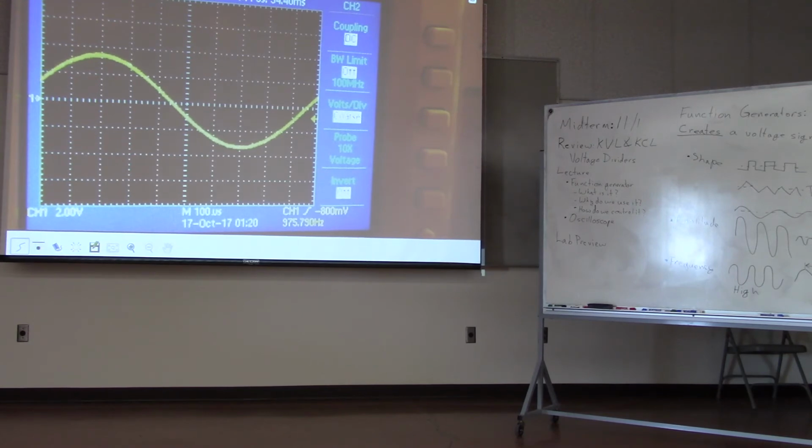If it had a period of 1 millisecond, what would the frequency be? Remember, frequency is 1 over the period, right? Well, 1 millisecond is 0.001 seconds, right? So the frequency would come out to be 1,000 hertz. Okay? 1 over 0.001 is 1,000 hertz. So a period of 1 millisecond gives a frequency of 1,000 hertz.